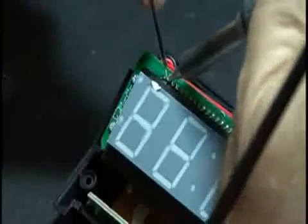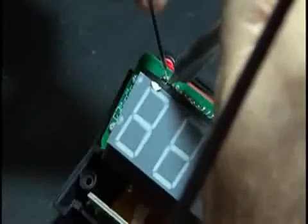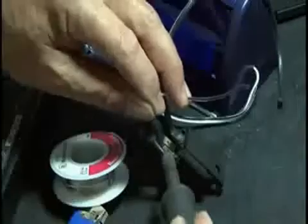I soldered 2 wires to the switch that go to the existing speaker and closed it all up because it's time to wire everything now to the relay. So I began soldering in the wires for power, the 2 wires coming from the clock radio, and wires going to the horns. Heat shrink tubing was added and our relay is done.